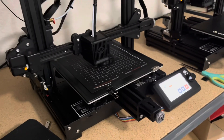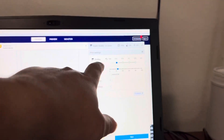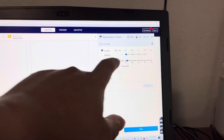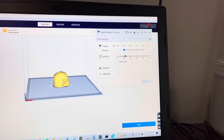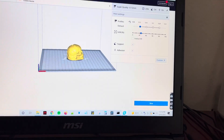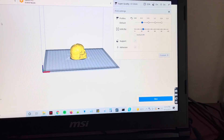Printed one out still sounding terrible. So for our profile, our default was actually at 0.2. I changed it to 0.12 and that made a huge difference. Also the infill needs to be at 25 percent, not 20. Whenever it was making the insides it was kind of collapsing at 20 percent, but at 25 it held up a lot better.